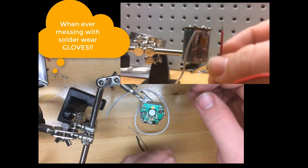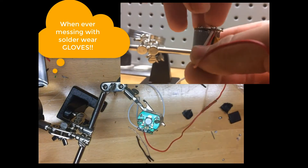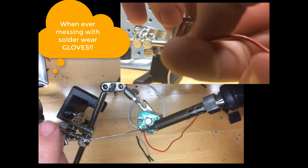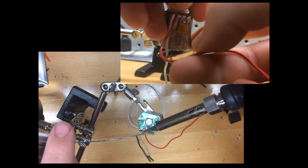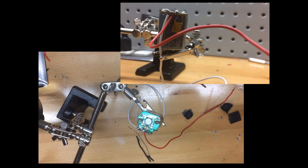When you put in the red wire, you're going to put it in the hole next to the yellow capacitor. When you solder it down, make sure that the red wire and the prong on the yellow capacitor have solder between them so that they are touching.